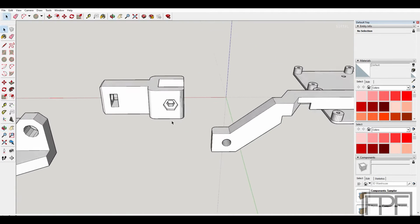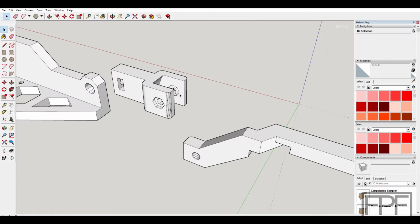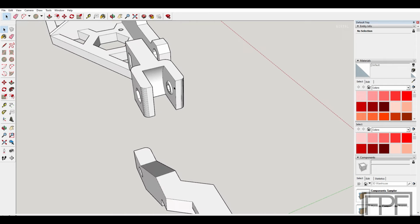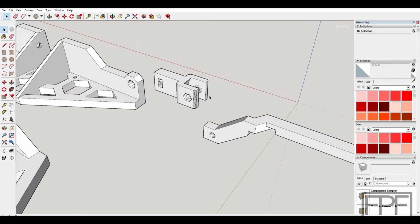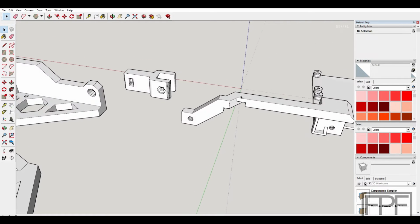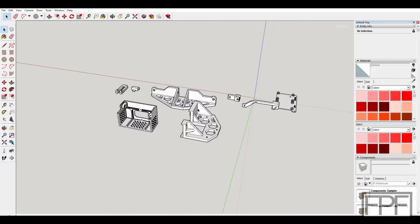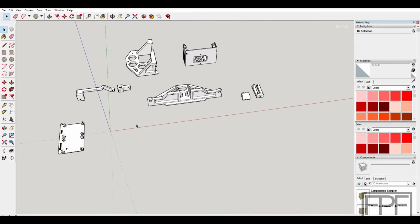And this one I modified. This one I didn't design from scratch. I believe I either had to lengthen it or shorten it. I can't remember which. But this is the side over here that gets yanked on from that thumb screw and machine screw. And it's pulling on the tension for the Y belt. The bearing for the Y belt, the little pulley, rides inside of here. And I think I had to modify the width of this to work with the bearings and pulleys that came in the ANET A8 kit, so I didn't have to buy new ones. So I think that is it for all the parts that we talked about in the printer. Let's go back and see what else I missed.